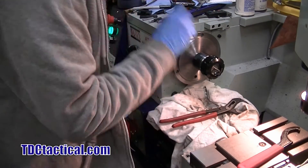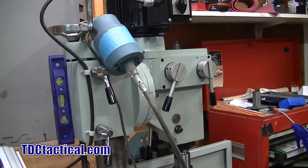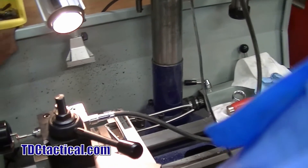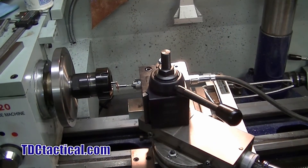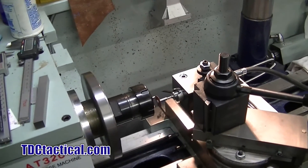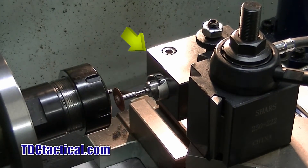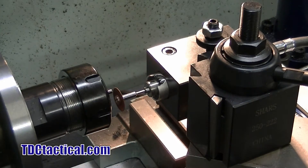I'll set that once I have my tooling on, so I can gauge how far in or out I need it. It occurred to me that I needed a tool post grinder, so I took my rotary tool — the pedal for it is right down here — and now I have it chucked up in my lathe. What that is, is a boring attachment for a boring bar. It just so happened that it worked perfectly with the flex shaft on this moto tool, roto tool, whatever you want to call it.